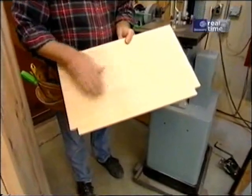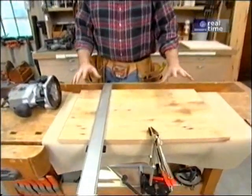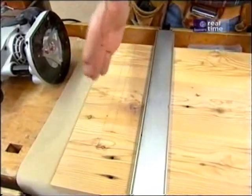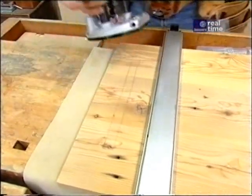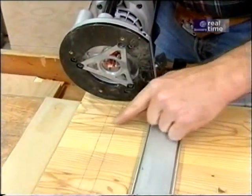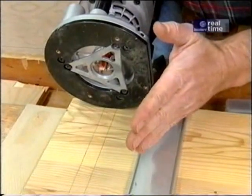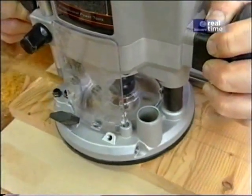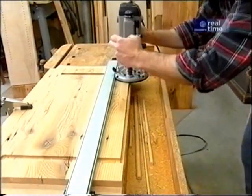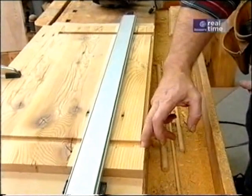This piece of plywood is for the bottom shelf, and I've made a couple of notches to let the face frame fit by. By now the blank for the top had cured, so I took it out of the clamps, sanded it, and sized it. I need a dado along each edge to receive the side panels, and I'm going to use my router to do that. I've set up a guide fence against which the flat side of the router base will run. The layout from the edge of the fence to the far side of the line is equal to the distance from this edge to the far side of the cutter. I'll make one pass, slide the fence over, and make the second pass. With a straight edge across the back edge of the top, I've also made a rabbet to receive the 1/4-inch plywood back.